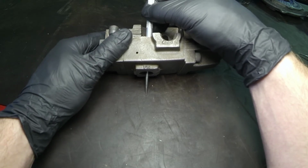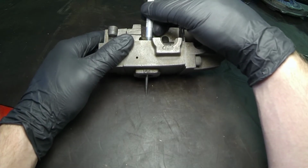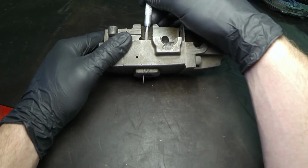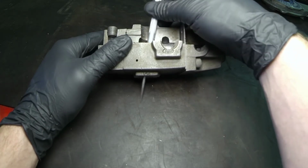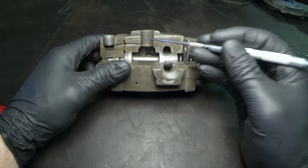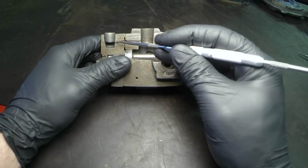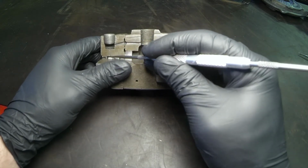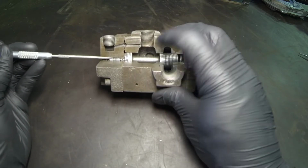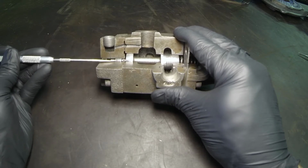So it's really a priority valve. It says do this thing first and then do that thing. So it does that by pressure. Let's say it sends the oil from directional control port A into this port right here, goes to the cylinder until it dead ends. When it dead ends, the pressure builds up from the directional control valve, comes down through this little passageway right here, down to the bottom side of the poppet, and that little sealed poppet with the labyrinth seals there is then going to create enough force to cause this piston to lift.